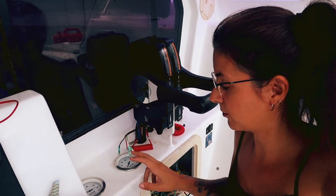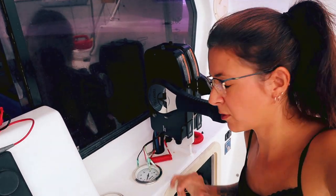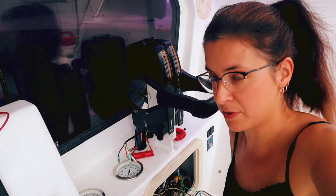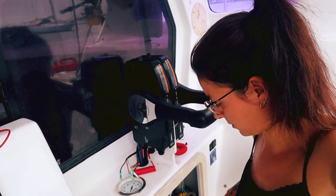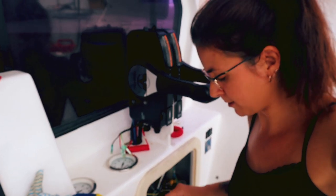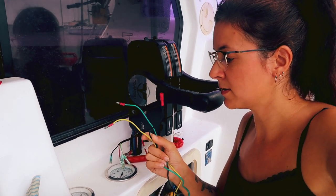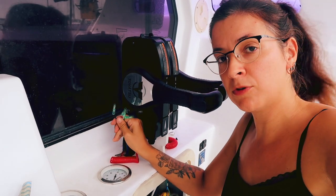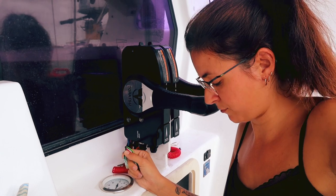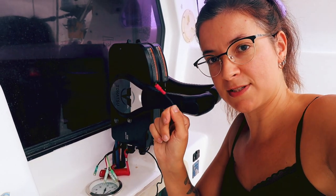One of the last things we need to do is plug the tachometers - these are the instruments that tell us the RPM and hours on the engines. Because we can't reset the hours to zero we can't trust that, but we really just want the RPM. It's not going to be simple plug-and-play because these are generics. From the tachometers we get three cables: black, yellow, and green. One is for ground and the other two are for ignition and send. From the control box we get four cables. Both blacks are for ground so they need to be plugged together, but we have two female connectors so we need to convert one into a male first.